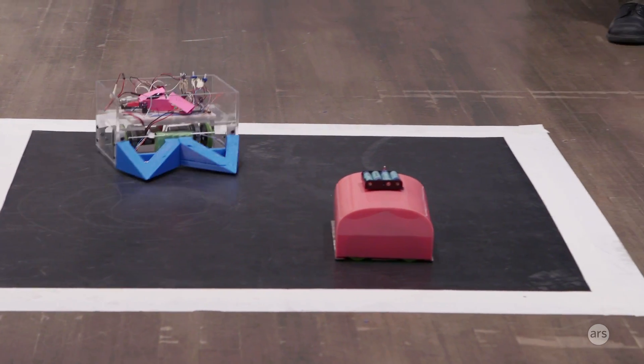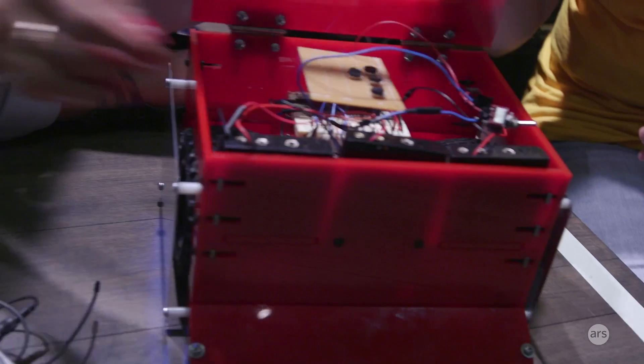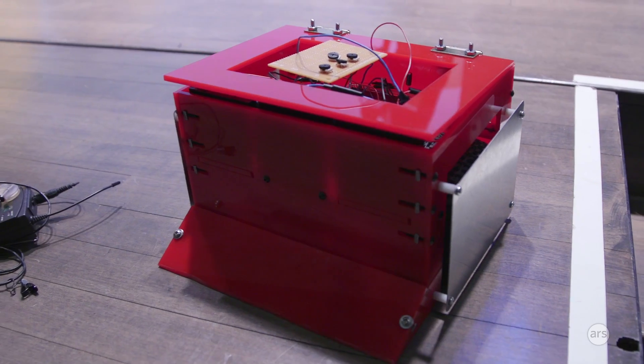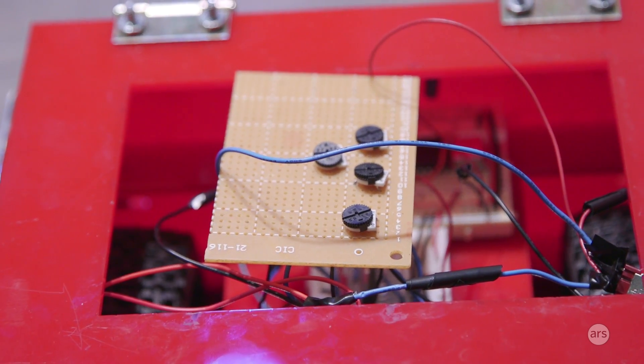In this case, the decision is to avoid the edge of the ring. Working together was actually really easy. The most difficult part was getting our infrared sensors to work. The robot has two infrared sensors that sense the difference between white and black, but they're very finicky. You need to be able to change the brightness of the LED and also change the threshold at the same time to tune the robot. That's why we implemented a perfboard on top with four potentiometers to control those features of the infrared sensors.